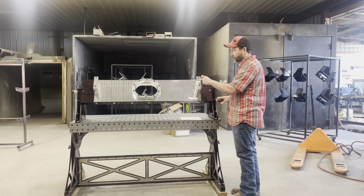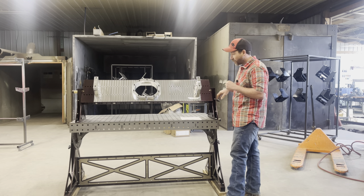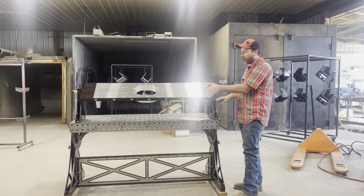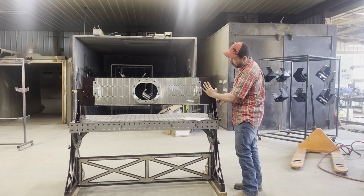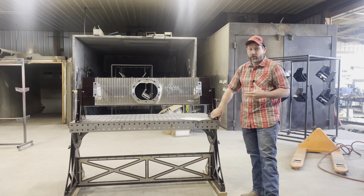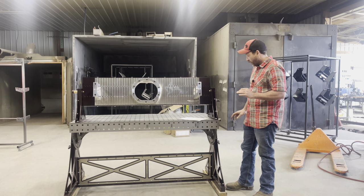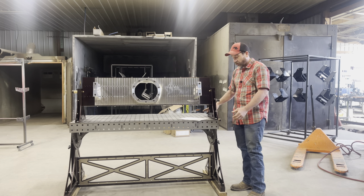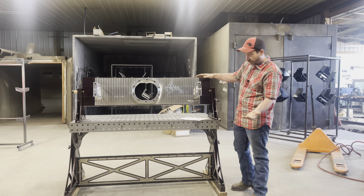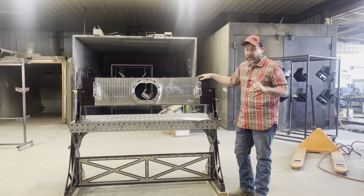There are different tube axle clamps — three inch, three and a quarter inch, and these happen to be 3.5 inch tube clamps that are on here right now. As you can see, this table can lock at 10-degree increments and can rotate all the way around, so you can get that perfect welding position all the way around on a rear end. I have this one on the edge, which a lot of people will use, but you can put this anywhere on the table, forward or back in the center. I do not recommend, if you have this on a rotary table, to rotate your rotary table with the Pro 9T on top of it — this makes it off center on the rotation device.